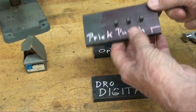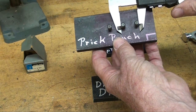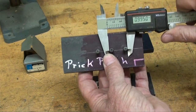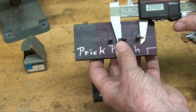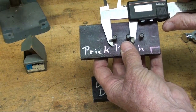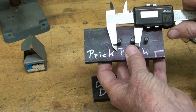This is the one done by the prick punch method that my brother Jan of Cody, Wyoming showed me many years ago. We'll put the caliper across that — we're within five thousandths on that. Well, that's about equal to two hairs — fairly close. This one is within a thousandth. That's pretty good.